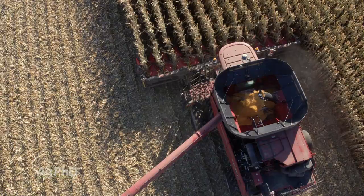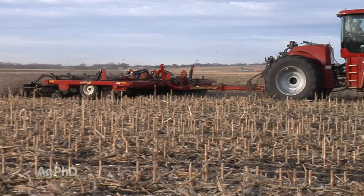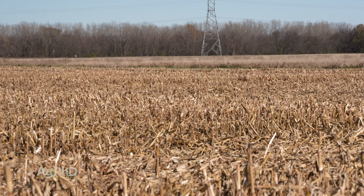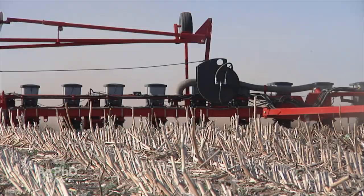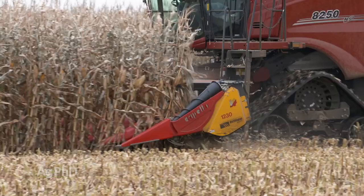What I'm concerned about is when we used to leave the stalks standing taller. Whether it was conventional till and we didn't chop it up well, or if it was no-till or strip-till and we left all these tall stalks out there — they'd tip over in the spring. We're planting when it's cold and wet, and we simply couldn't cut through that with our coulters very well, so we hair-pinned a lot of residue and had a lot of stand issues. It was a disaster for us.